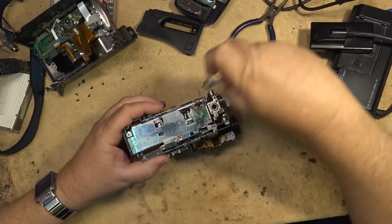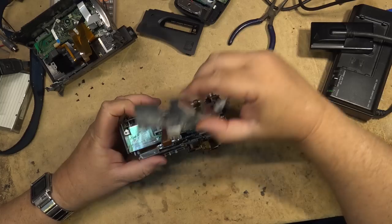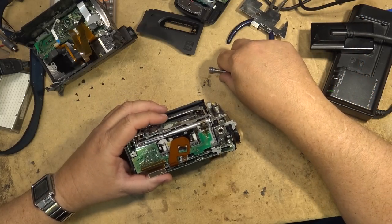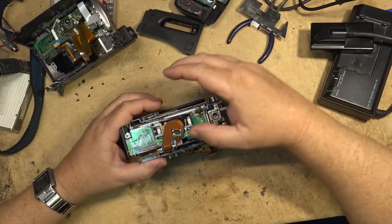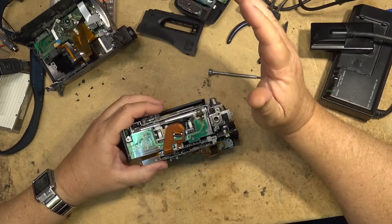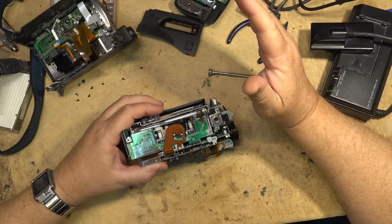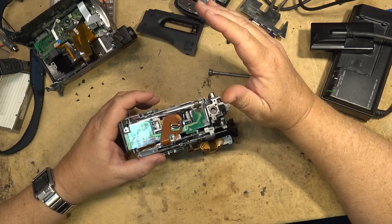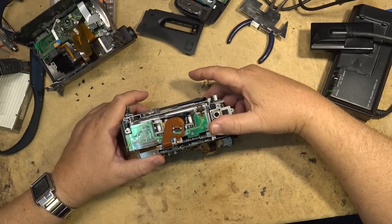Real common problem on these. When you get a machine that you've cleaned the heads and cleaned them and cleaned them, don't clean them with a cleaning tape more than four times, because if they don't come clean within four cycles, it's not a dirty head. Okay, it's another problem. And it's very likely the problem that I'm going to show you here on the head